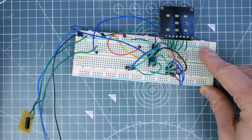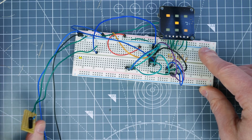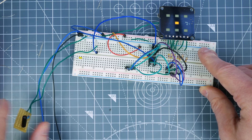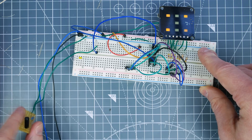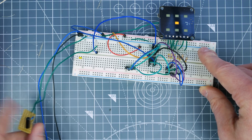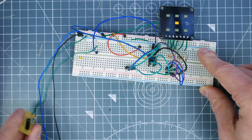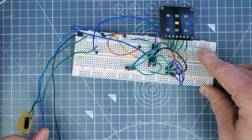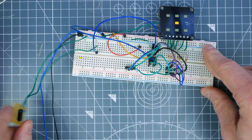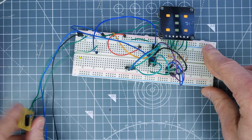One of the problems I've got at the moment: you'll see it woke up and then immediately went to sleep again. The shake switch has a timeout attached to it — if it doesn't detect another pulse for a second, it stops and disables the shake switch. We've just got a one there now, and this shake switch is now disabled, so I can't do anything with it. Once it goes to sleep again, I can activate it again.